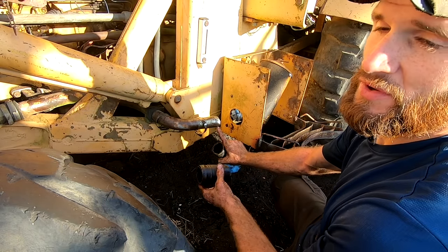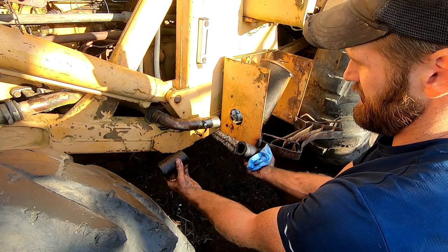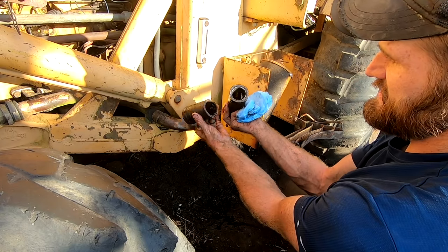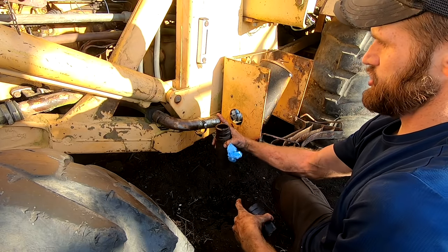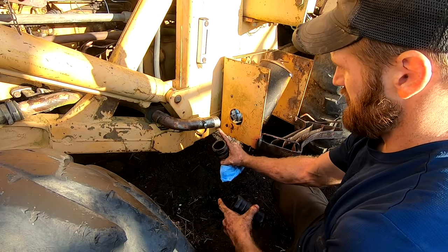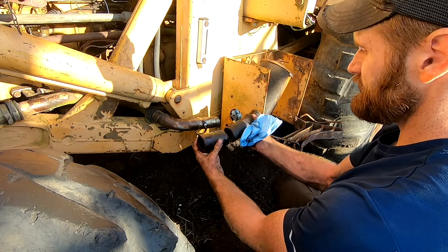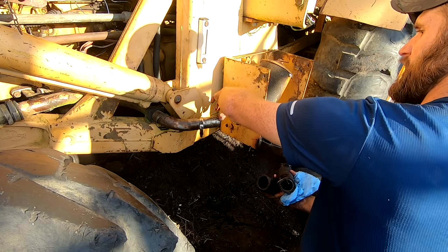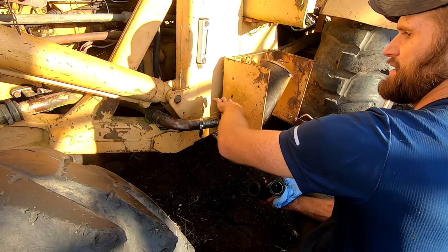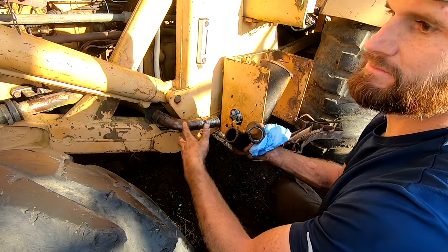Started with a hole, wasn't coming fast enough, so they cut right through it and then had a bucket down here to catch the fluid. Because, I mean, even the metal banding in the tube is cut. That piece of pipe right there should be about that much further. And the hole in this on the bottom, those shouldn't exist. So, long story is, I'm gonna get a new tube and just go from here to here. I'll probably clean up some of these burrs that they left so they don't get in the system, wipe it out really good, and then, you know, hose clamp it back on.